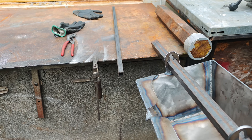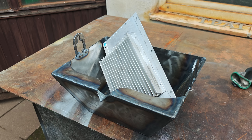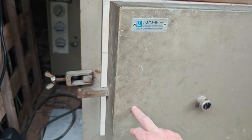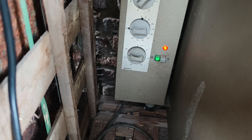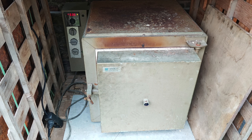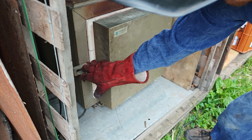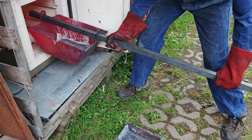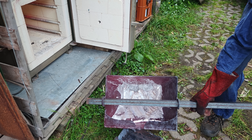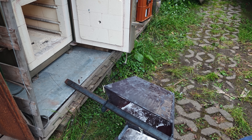With all this done, it was time to heat up the kiln and test the new setup. The specific alloy used for these extrusions is probably not ideal for aluminum casting, but good enough for simple experiments like this. After loading the scrap into the kiln and turning it on, we measured 535 degrees after an hour and 15 minutes, and after two more hours the oven was at almost 740 degrees — the aluminum should be in molten state now. The idea is to pour the aluminum into the smaller crucible slash mold to get an ingot that we can then reheat much easier and quicker in the smaller furnace for actual castings later.